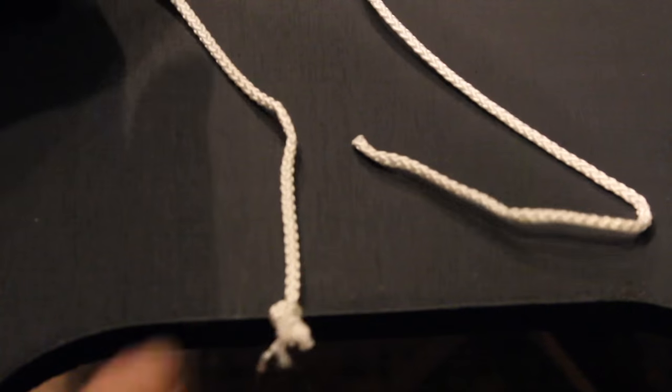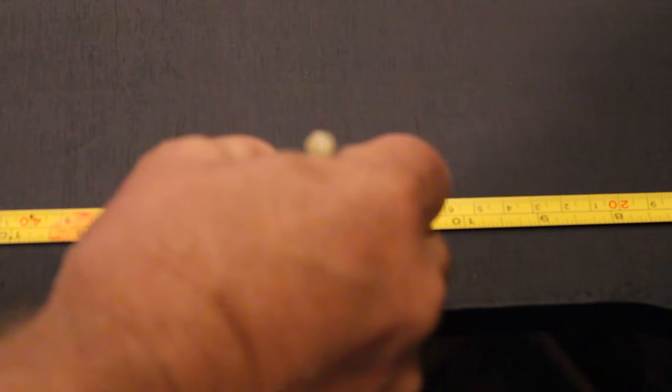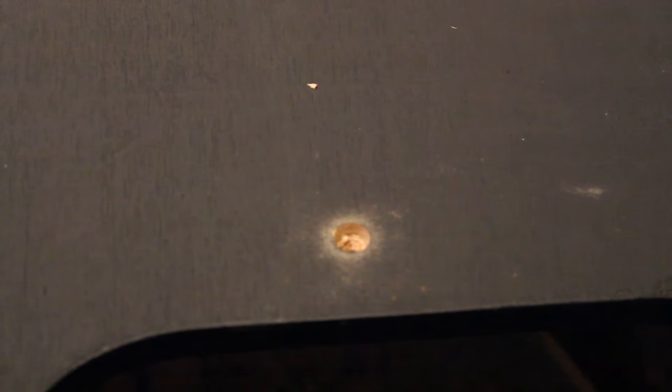Next, I'm going to put the string in which holds the bottom of the board apart. Some nylon rope there, probably about four or five millimetres across. Mark the centre and then with a forstner bit just sink a hole halfway through the wood. And then get another drill bit and finish the hole off. There's a piece of tape on the string to get it through the hole, but before we do that we must make the whole thing black, so pop a bit of paint on and wait for it to dry.